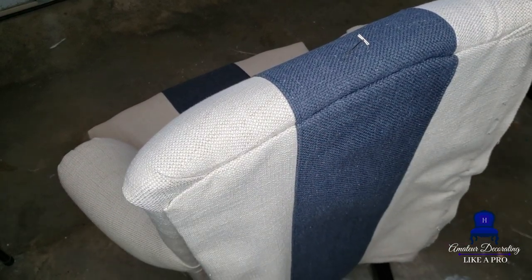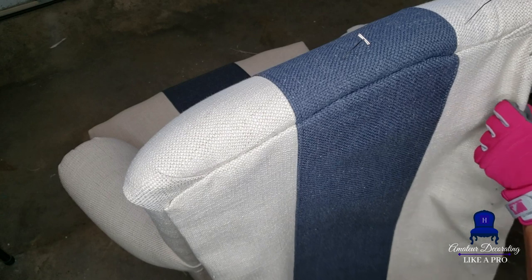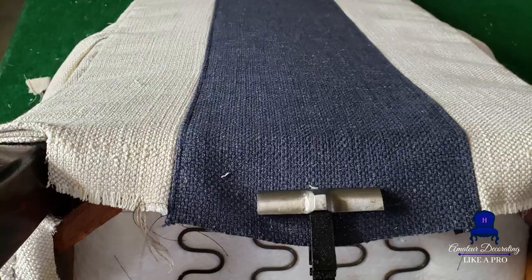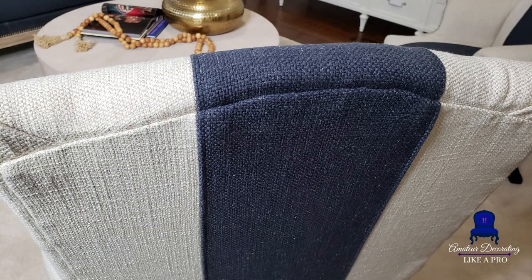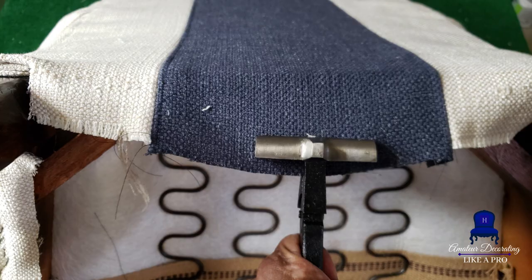I am now applying the metal tacking strip, putting on the outside back. You start on the left side to the right, or right to the left, and work your way down the back of the chair. You want to try to keep the fabric evenly distributed on both sides. This fabric has been stretching on the back of this chair for some years — it is repurposed, so it's already been pulled, and having taken it off I now see the result of that. I begin stapling the fabric to the bottom of the chair from the center. I love these upholstery pliers — they help me so much.